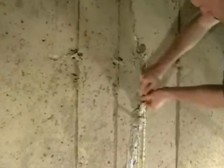And you can use the plastic trowel to do this, actually, to remove the surface seal. Do it within 24 hours. Ideally, if you can do it an hour or two after you've injected the urethane, it'd be great. In terms of injection, some might call that a hairline crack you see there, but that's a larger crack for the urethane to go through. It'll go through that readily.